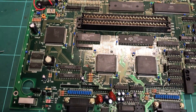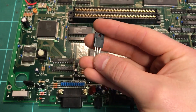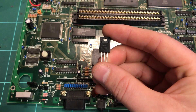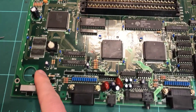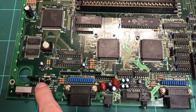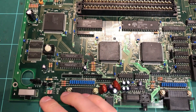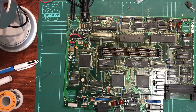It's actually about two and a half weeks later and the parts finally arrived. These are direct replacement NEC A1442 power transistors - that's fitted. And the other little transistors I found direct replacements for as well, as well as the other components. They're all in and it does seem to work, but there's more problems.